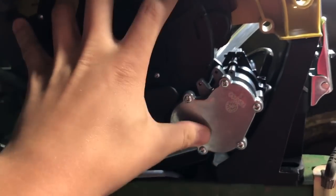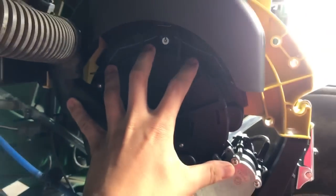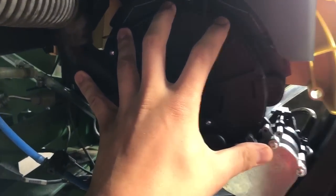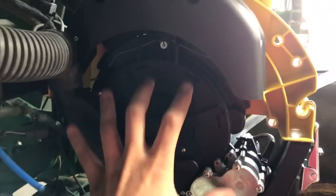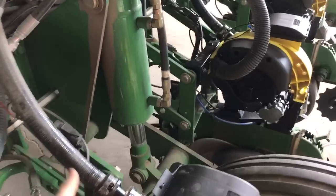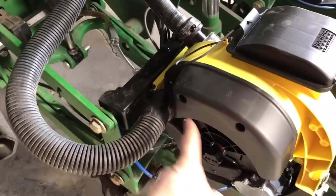So this is the actual meter, as I understand it — the motor. This is the hopper unit. This black portion right here — back up with my phone here. My GoPro charged all night and now it says 0% battery, so that's wonderful. So this part folds open; you can change the discs. If you want to plant soybeans, the brush settings clip in there. This line here connects to the hopper, goes back to the tank — that's where you get the seed. This hose creates the vacuum.